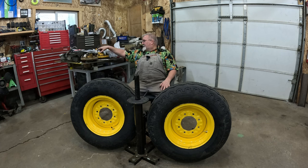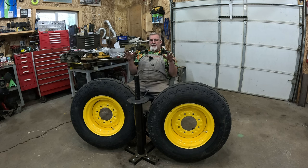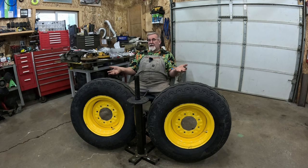We're going to take the center. These here are rusty too, but they're so thick. Even if you knocked it off and did some rust converter and didn't do anything else to it, it'd take 100 years for that to rust into something unusable. But as I put all these nuts and bolts back together in this tractor, I will definitely be using Never-Seez. I'm going to chase the threads on the tractor. It needs threads chasing before I put bolts back in. I'll put Never-Seez on everything